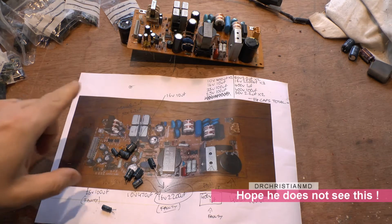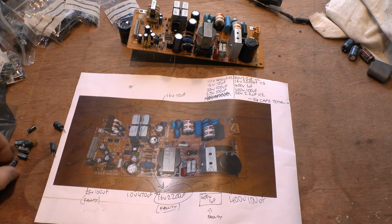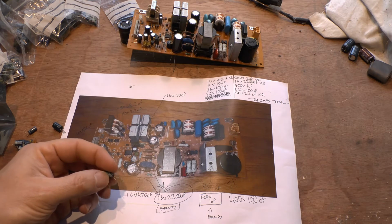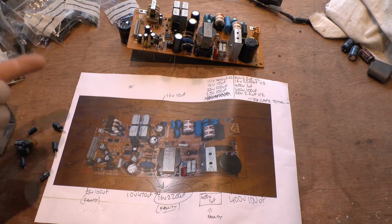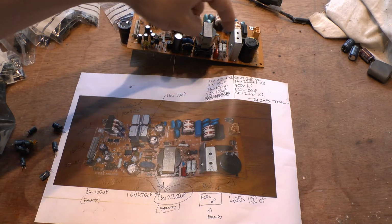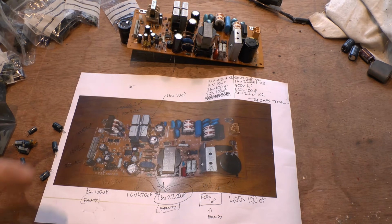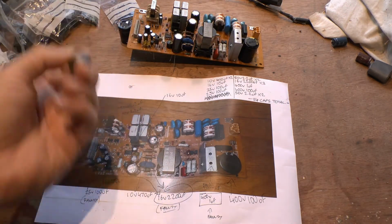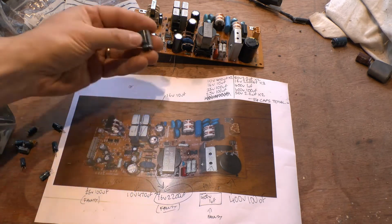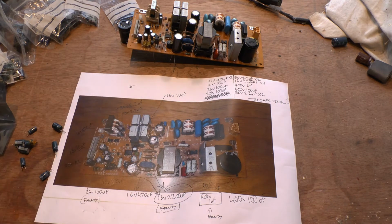Anyway, one thing you should take note of when you're taking the capacitors out of the board is to verify that the white stripe, the negative side, is lined up on every single capacitor. What I mean is, when you're taking them out, make sure you take note of which way they were orientated in the slot, because sometimes the manufacturer may have put the negative on the wrong side. You've got to take it that the original person who installed the power supply parts did it correctly, because obviously the power supply was working. It's now not working. So if it was inserted with the negative on the positive side, as it were, you'd better put it back in that way, even though the board will tell you it's negative.